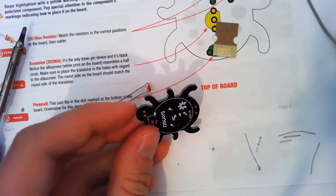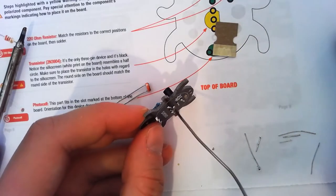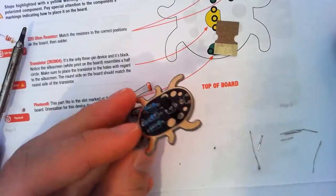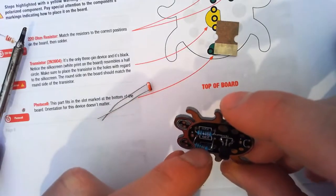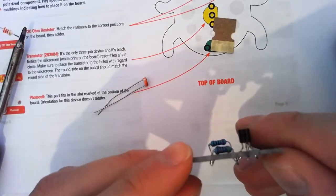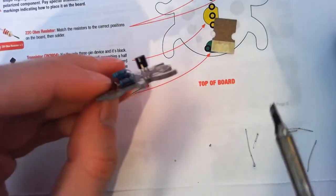Alright, so I just quickly soldered them up and cut them off, and you'll notice we have a problem. Right here, these two are touching each other. Because I folded them out, they ended up touching each other. That means they're making a connection when they may not be meant to. And this one is sticking out an awful lot. Obviously it just worked its way out when I was soldering. Look at that, way too high. So this means we need to get them back in.